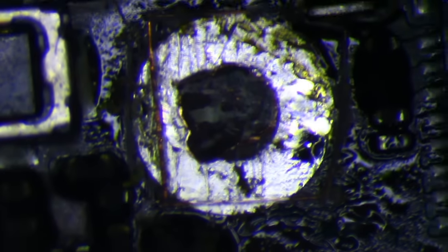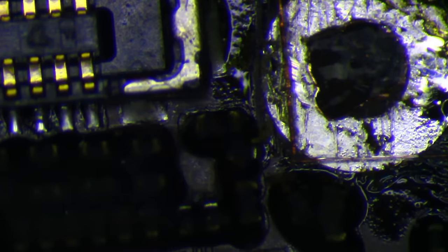There's no way you're going to be able to see it, but we've got image. We've got no backlight though. So now we need to start looking at what are the problems with the backlight circuit. Long screw damage is not going to be a problem with the backlight circuit.